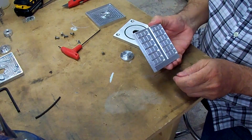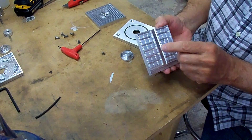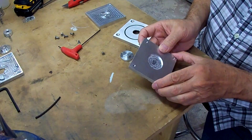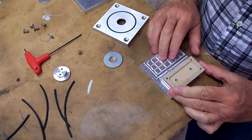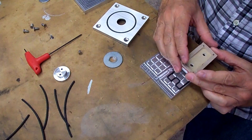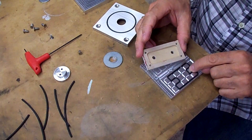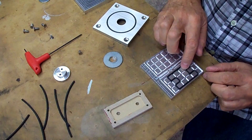In here I've got to be careful where I place my holes into the grid to make sure it falls within this area here. This is the part that goes on this fixture plate, and this is the way the gasket will be, so we won't lose suction when we drill through those holes with the router bit here and here. So I've got to come up through here with the suction.